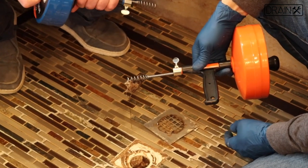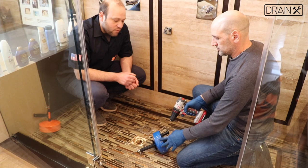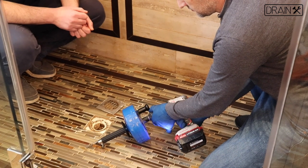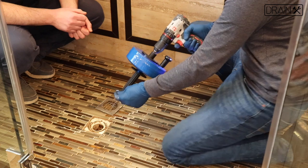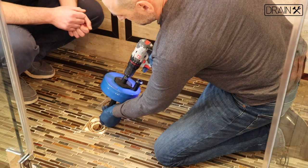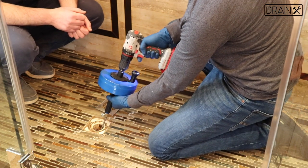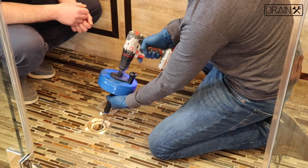Now we're going to show you how to follow the same steps using a power drill to clear a shower drain with a drill-powered steel drum auger. This is our 35-foot version of Spin Grip. First, we're going to connect the drill to the drum, then loosen the thumb screw and manually extend the snake down the drain. You will still need to manually extend the snake. We do offer a spin feed auger which automatically extends and retracts the snake; however, some people prefer the control of manually feeding the snake.